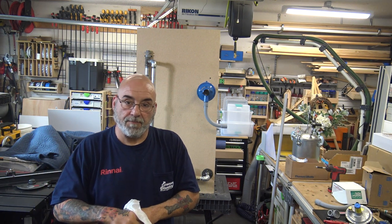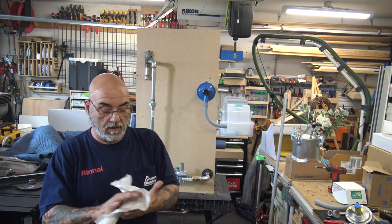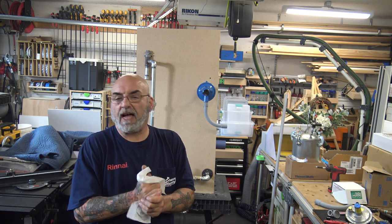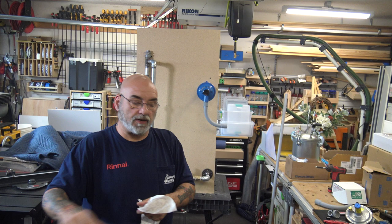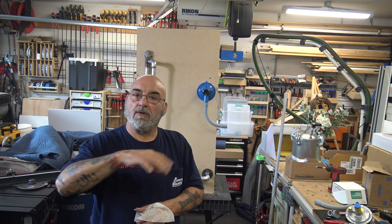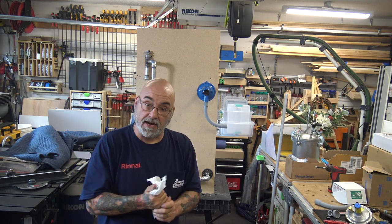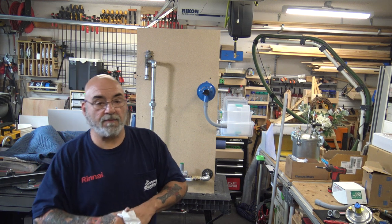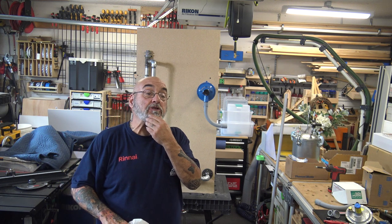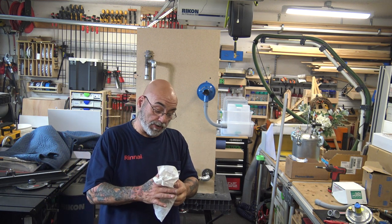And for a rule of thumb, for a tankless, pool heater, water heater, boiler, fireplace, outdoor stuff like that, even an indoor, you're running 2 pounds and you come up the back of a fireplace and you're going to go in, you want to be 3 feet away. On a generator, most of them are going to be Generac and Kohler. You could do a CAT or, you know, generator.